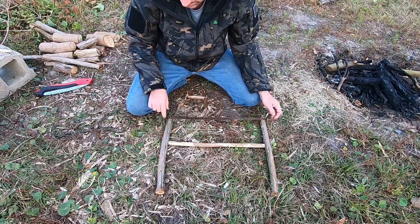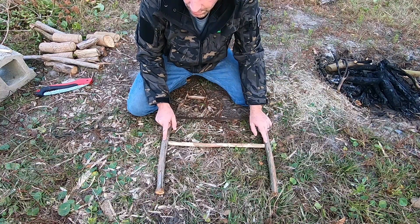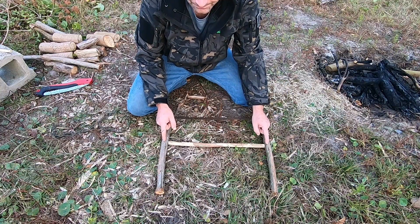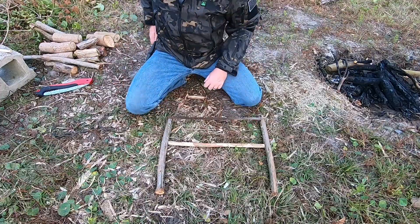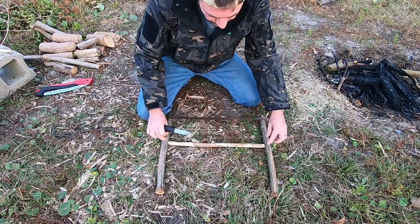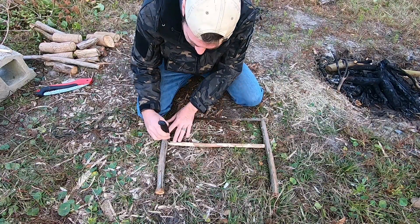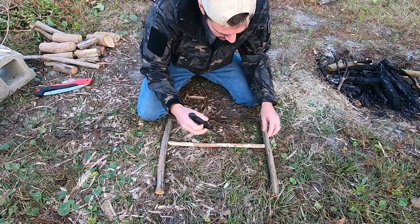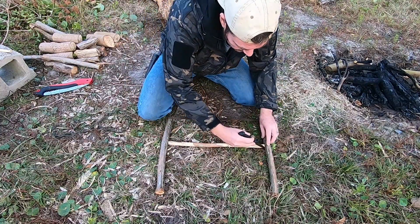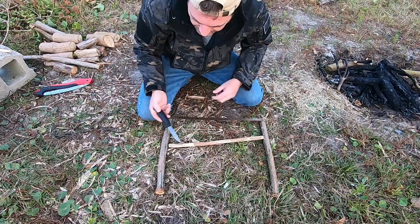So first step — we need to notch our material. I'm looking at our holes in our buck saw to see how much notching we can do. You never go over half the distance of your upright — once you get into that center piece of wood you're going to wind up causing a break. So you only want a little bit in there. I'm going to get my knife out and try to level everything off as much as possible — kind of score where we're going to put our notches for our upright. That way when we notch it out, it'll be easier to do.